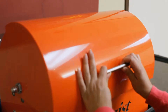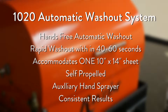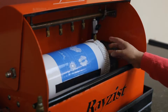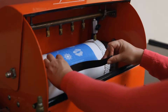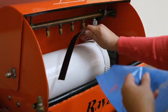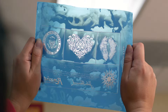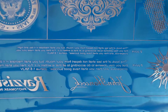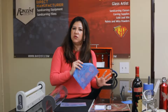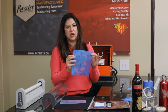I'm going to close this and turn on the valve — it's a water valve. Let's take a look at our sheet, it should be washed. Yes, that looks really nice. All you have to do is remove it from the drum and put it in your dryer or lay it flat and the mask will dry on its own. Now that I've washed out my sheet, I always like to hold it up to the light just to make sure that I have everything washed out and all my detailed areas are nice and clean. Here I have a nice clean sheet. The 1020 automatic washout system is perfect — it's hands free. You load the sheet, turn on your water valve, it takes anywhere from 40 to 55 seconds to completely wash one sheet and you're done.